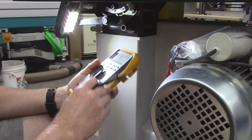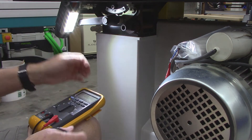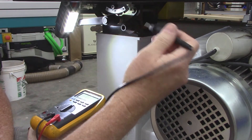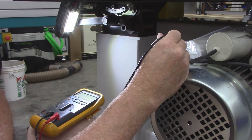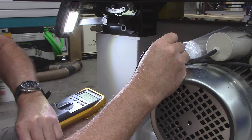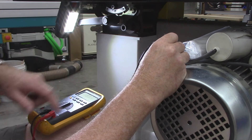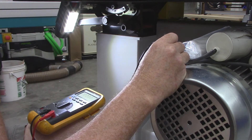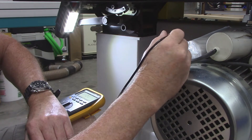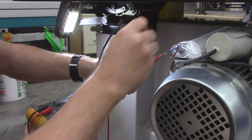I'm going to touch the lead at the 45-second mark of this minute — and I'm there. This is charging, and for an 80 microfarad capacitor it should stop moving and return to a steady display. I'm at 28 seconds, so this is 80 microfarads. I'm going to short across these terminals to discharge any residual capacity. This replacement capacitor tests good.